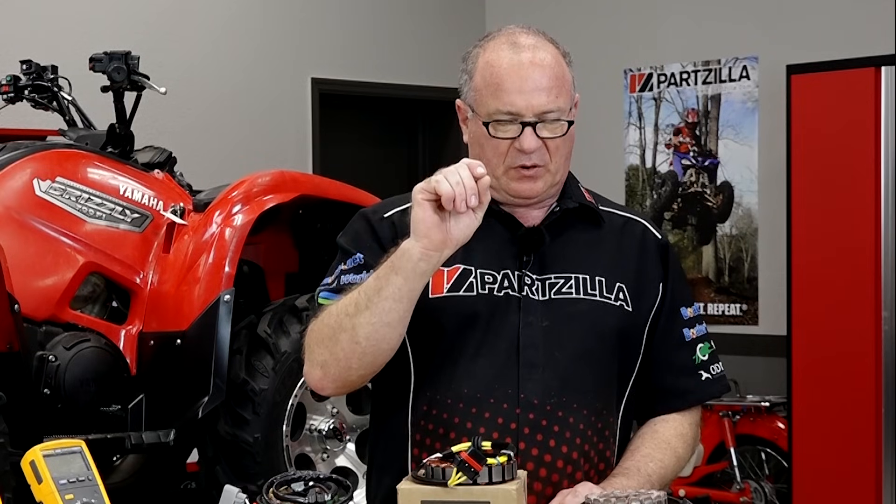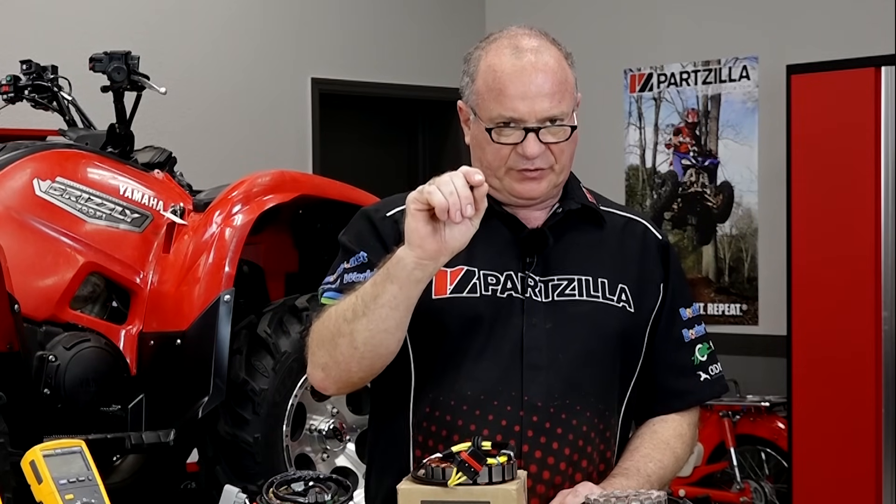When I'm talking about phase to phase, I'm talking about the windings of each one of these coils. What you can't see, but what is actually inside of here, is a Y. You've got that center point where all three of these coils are connected in the middle, and then the end of each one of those coils is represented by the wire coming out to this connector. So it looks like a Y — and this is what they call the Y configuration.